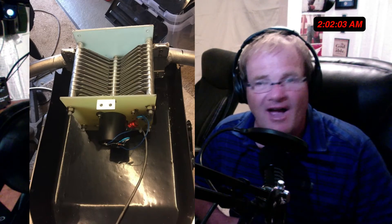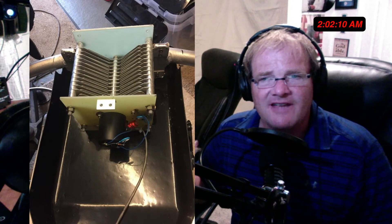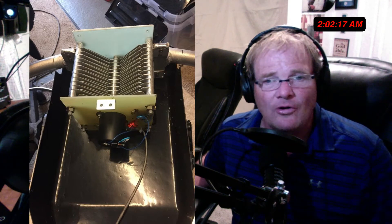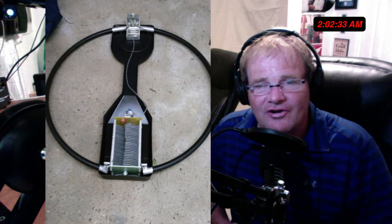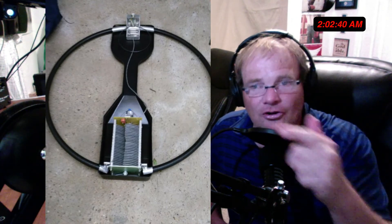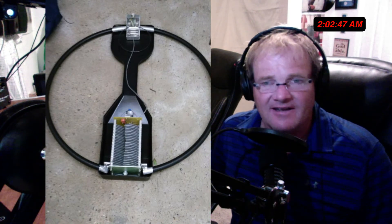It works from 15 meters to 40. It's the best antenna I've ever used, and that's no lie. If you're not using a loop antenna, you should be — you'll hear signals you're missing through all that environmental noise that dipoles and verticals pick up. Here's a blown-up look at it: the variable capacitor at mid-turn, and at the top you see the black loop. It's essentially a loop within a loop. That's how a receive loop works — fantastic at nulling out noise and bringing up your signals.